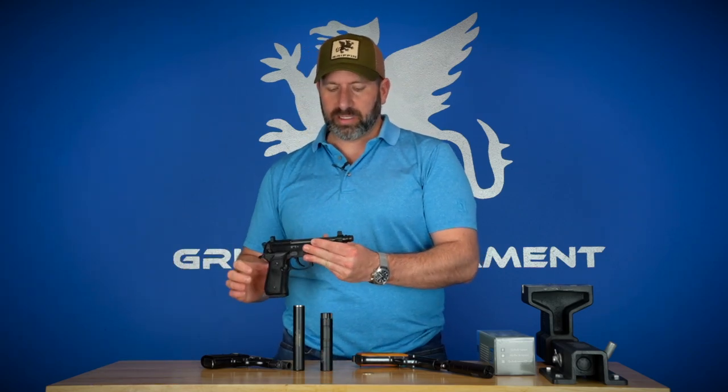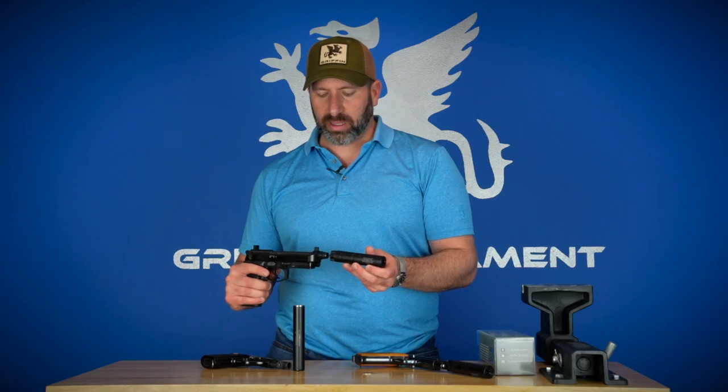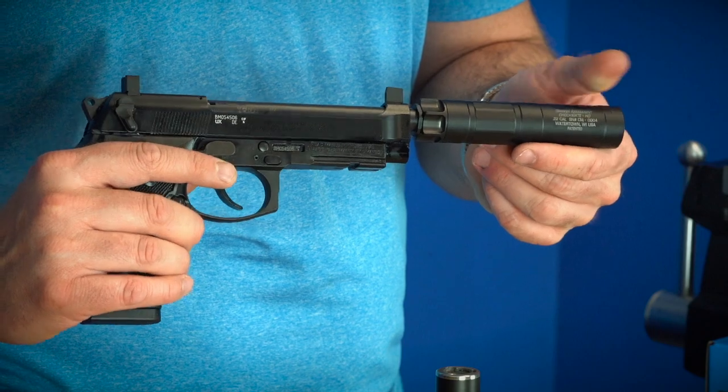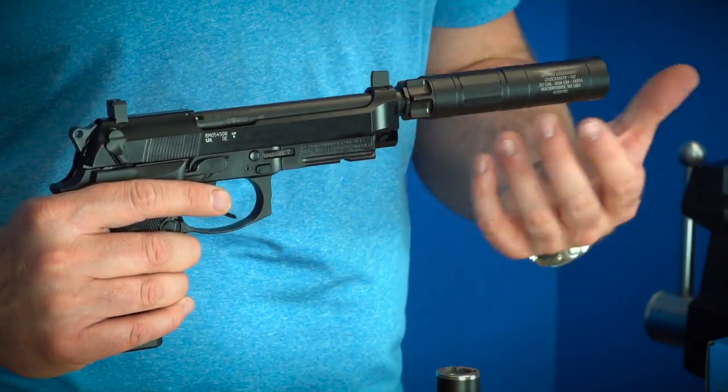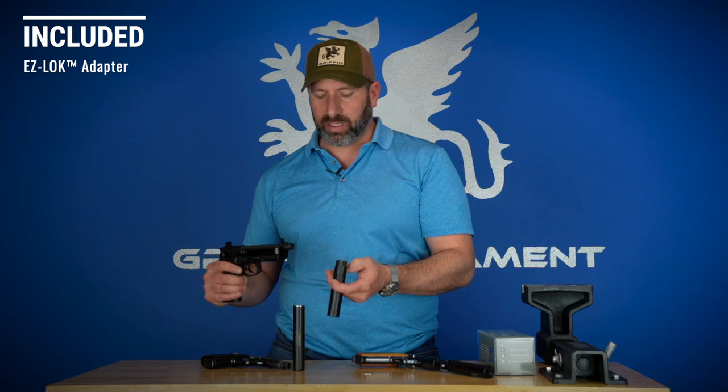Basically what it is, is a miniaturized taper mount for your pistols and rifles. It has an outside thread on it and an interfacing taper on the front of the adapter, so you can screw this on, it'll hit that taper, and now it's locked up really nice and tight. You don't have to worry about baffle strikes like you would with direct thread suppressors. The Checkmate includes one of these adapters as well as the Easy Lock interface on the rear. The other mounting option is the Cam Lock system, which is an actual three-lug version of the Easy Lock. We opted for Easy Lock because it's a little less finicky and very solid.